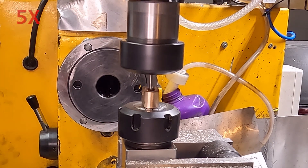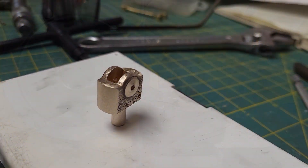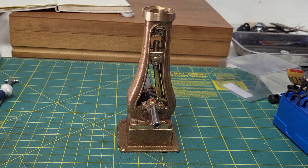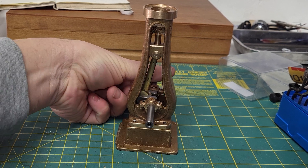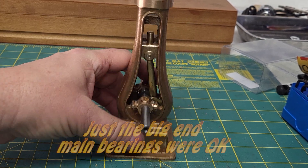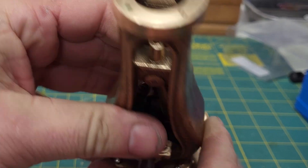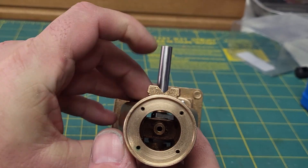Then I realized I'd forgotten the hole in the middle. I had to recenter the whole thing, drill the hole, and then tap it. Hopefully that's concentric but I'm not happy with this part. If I get perfectionist I'll try to rebuild it — it does rattle a bit, but it actually works. This is after running it on the electric drill for a bit to loosen up the bearings, which tightened up when assembled. It looks fairly concentric but I'm not 100% confident — we'll figure that out when we get the piston in.